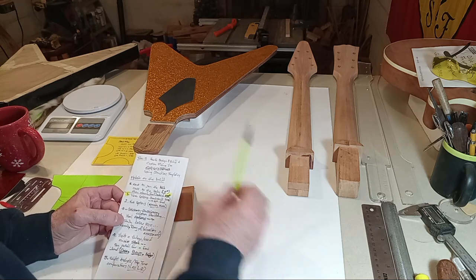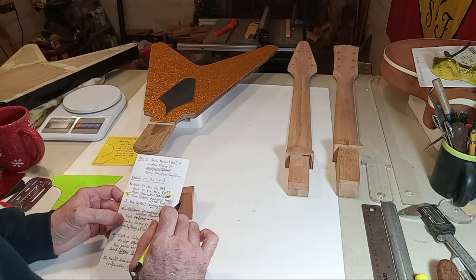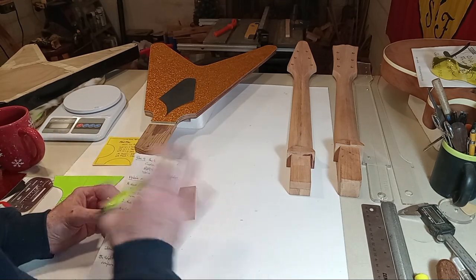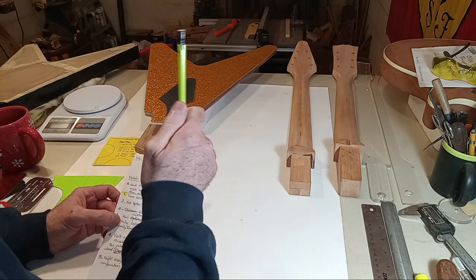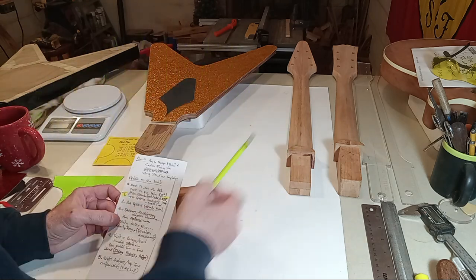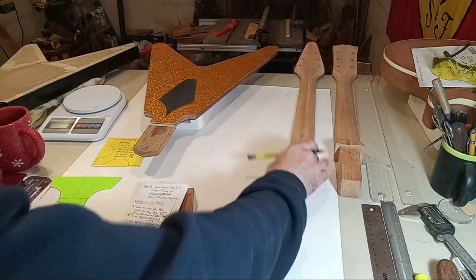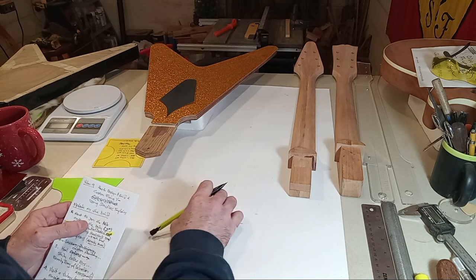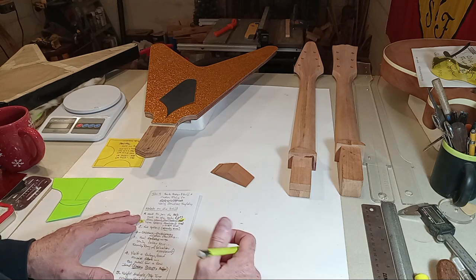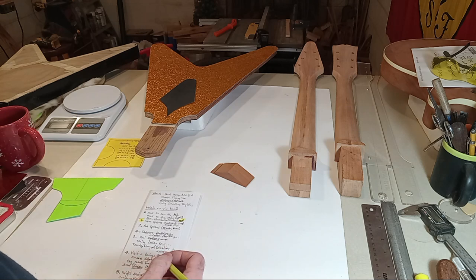If you're a really good woodworker and you want the guitar to have some value, I'd recommend going with a really pretty blonde limba — white limba that's very clear — and build the neck and body out of limba with a rosewood fretboard at historical scale. Do the real McCoy. You might want a slightly bigger headstock to be more traditional. If you ever need to unload that guitar, it'll be worth some money.